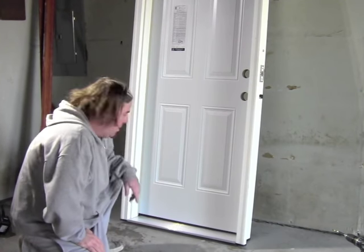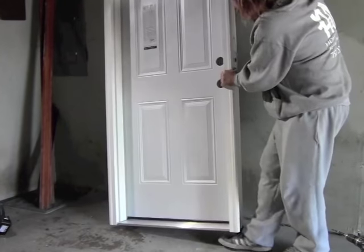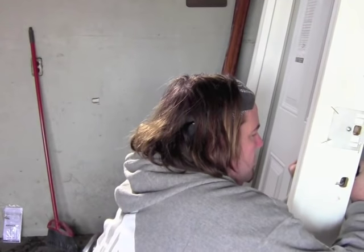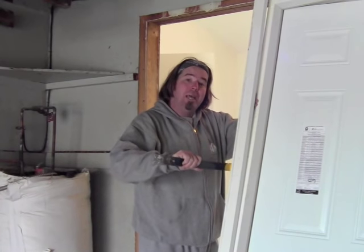Let's prep the door so we can get it in the hole. We're going to pull these little black tabs off. Got a hardware pack on top of the door — get that off of there, and we're going to remove this little lock piece. Now a lot of installation guys may tell you that you need to pull the brick mold off the door to do it. I find that's false — I like to try to put it in with the brick mold on it: it keeps it straight and it's less work. However, I want to be able to reuse that stained casing that was on the door originally, so we're going to pull the brick mold off before setting the door. Take a hammer and use your pry bar to walk down the brick mold just like you did the casing.